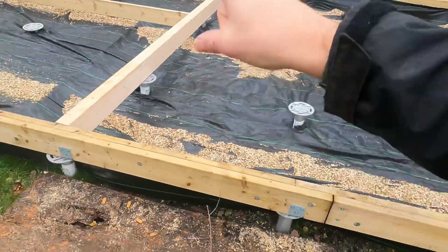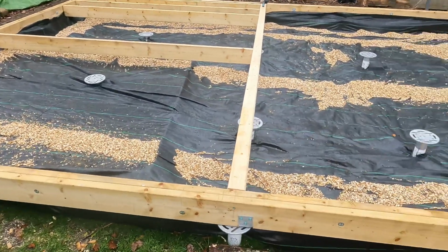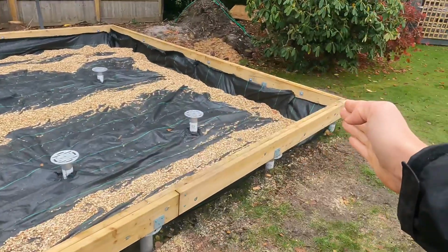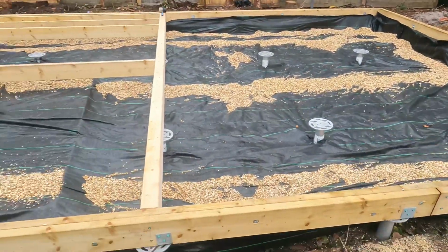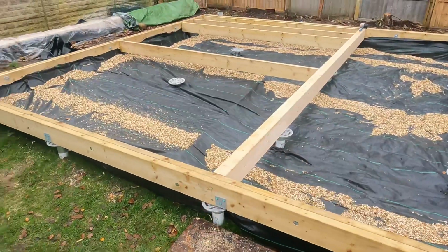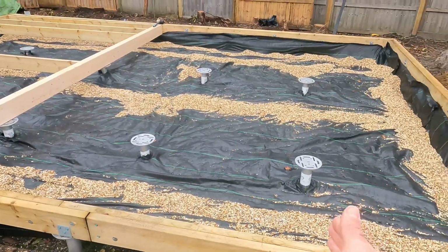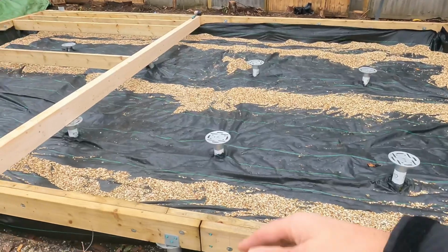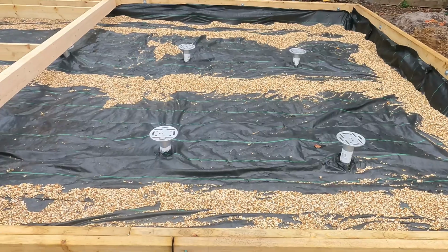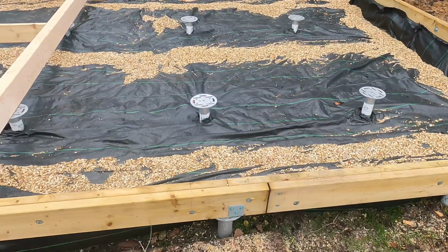So the clear span allowance for these timbers is 3.9 meters or 3.8 meters clear span. And from that distance there to that distance there, I think it's dead on 3.9 meters. So you don't really want to go to its maximum. So if I've got a glulam beam there, it's pretty much useless now. So I might as well divide it up there, and then you have a small bay here and a bigger bay here, or I might put it there, and it doesn't really matter. But at least it breaks it up then, and then the clear span from there to there is well within tolerance.